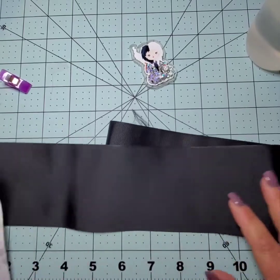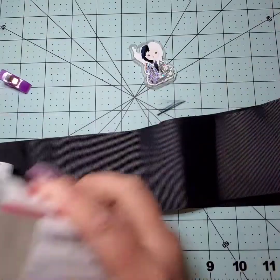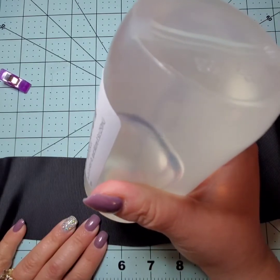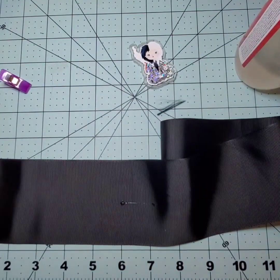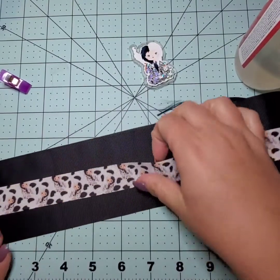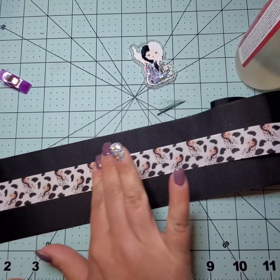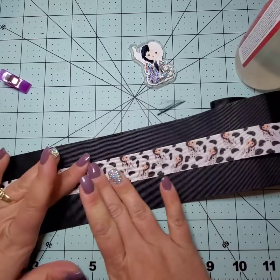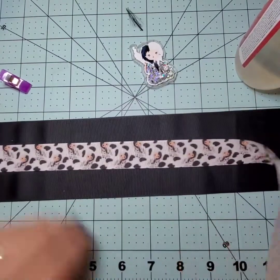I'm taking my finger and smoothing out any lumps from the silicone. Every few inches I'm just going to add a couple of dots and do the same thing — about that much, you don't need a whole lot. If I notice bigger gaps, I'll go back and fill in more later, which is absolutely fine. You always want to smooth out the silicone and rub off anything that runs out — you don't want to wait too long to do that.